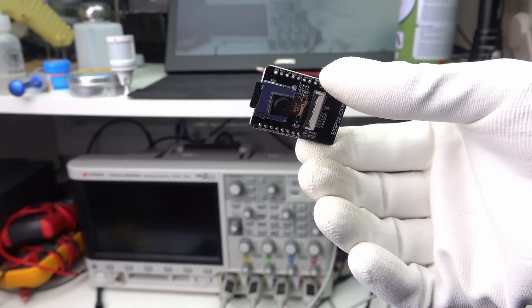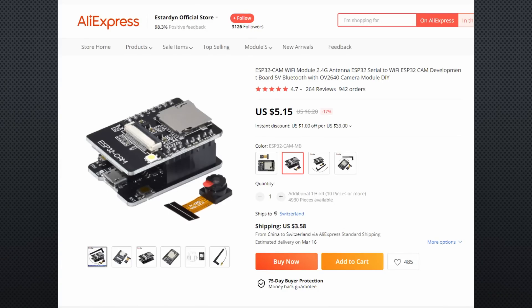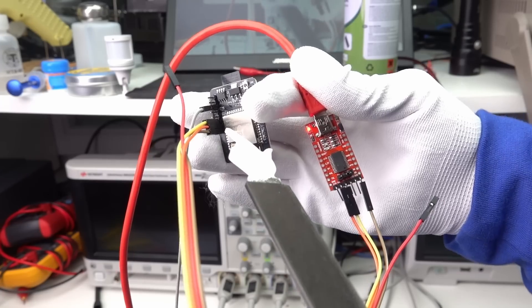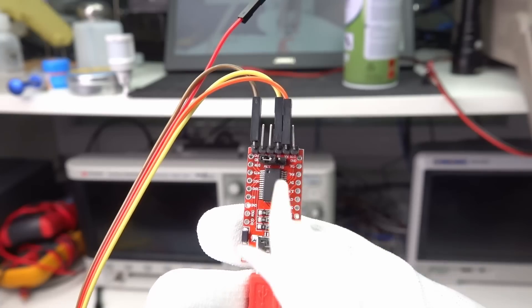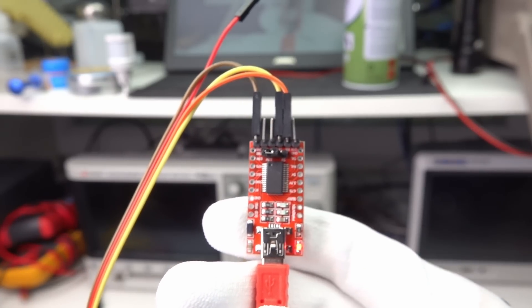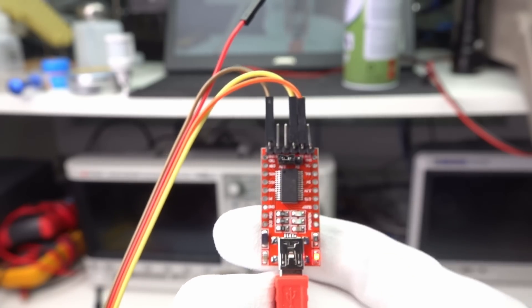The most complicated thing is that the ESP32 cam does not have an integrated USB-to-serial chip, at least if you did not buy it with the daughter board. So I connect this adapter to the RX and TX pins, then add a push button to ground GPIO zero while pressing the reset pin. All business as usual. Just pay attention that you switch the adapter to 3.3 volts, and check that the adapter also has 3.3 volts at the data pins — some of them do not and might kill your ESP32.